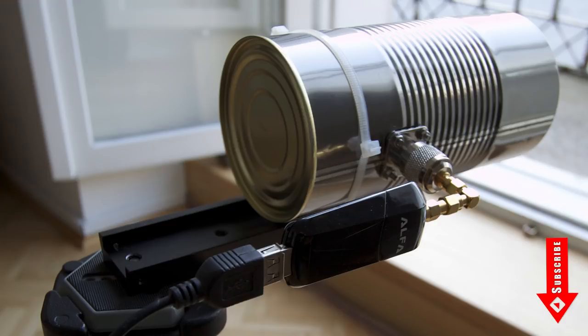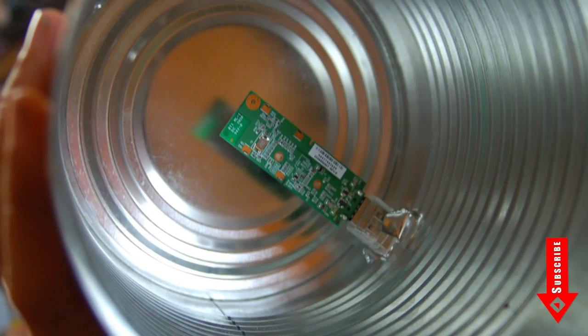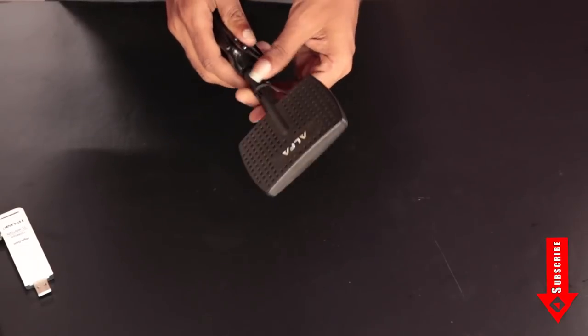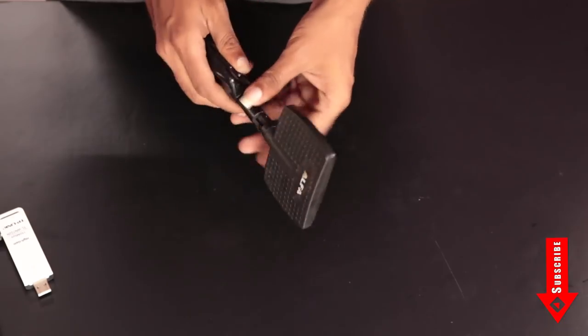Cantenna is one of the most popularly used antennas among hobbyists and experimenters. They are also highly directional and compact antennas which can radiate power at an angle of around 36 degrees. Focusing its energy on a narrow beam makes it highly directional, but the radiations are so powerful that you can travel more than 3 miles line of sight under ideal conditions. We can connect USB Wi-Fi adapters and Wi-Fi routers with removable antennas directly into this, which will significantly improve the range of transmission as well as reception.